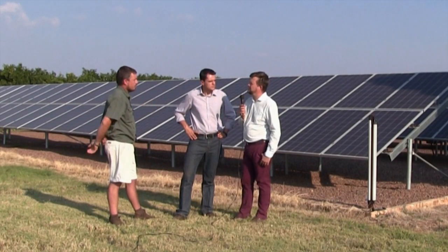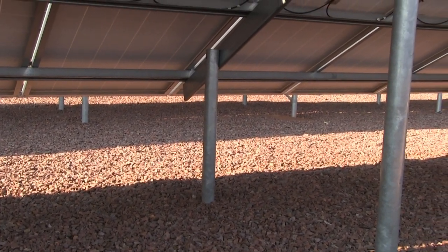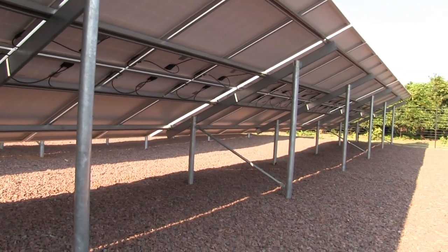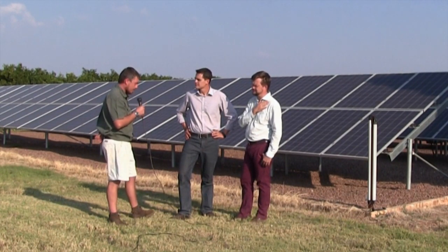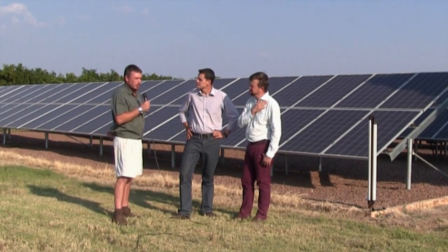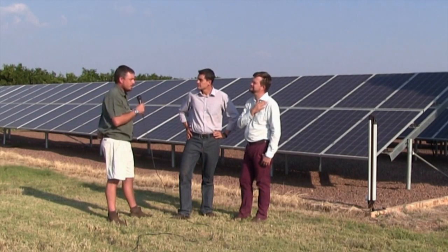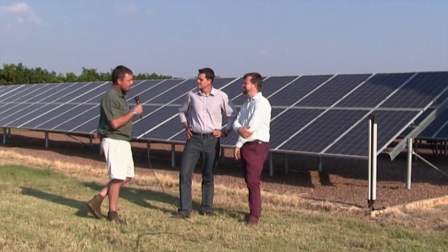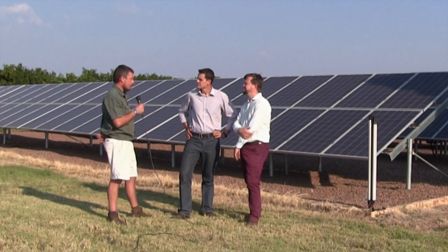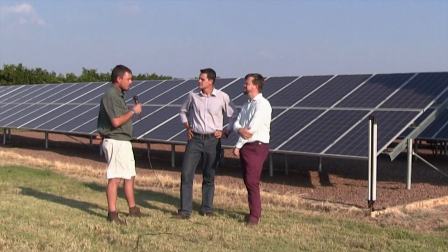As far as the plant itself is concerned, here we used auger drilling with poles planted into the soil. It was a bit difficult — you don't know what's under the ground. We drilled 1.2 meters deep, 300 millimeters wide. We had difficulty with old concrete foundations from tobacco ovens that stood here a very long time ago, and we also drilled into a swimming pool, so that was a bit difficult. Other than that, everything went well. We took about a month to a month and a half just for the drilling, and then the plant went up quite quickly — about another two weeks until switch-on. Always surprises with things we don't see underground.